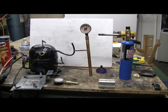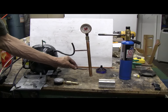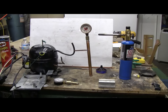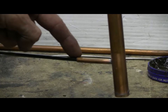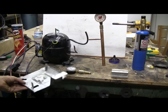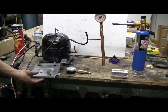The manifold is built and the pressure gauge is now loosely threaded onto the top — I haven't used thread tape or thread sealer yet. The manifold has been slipped onto the compressor's 3/16-inch steel output line, and there will be a solder connection here to hold the manifold onto the steel line. First, though, I'm going to build a wooden base for this unit, and I'll reuse the mounting plate I recovered from the fridge.